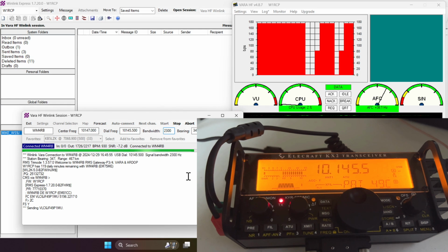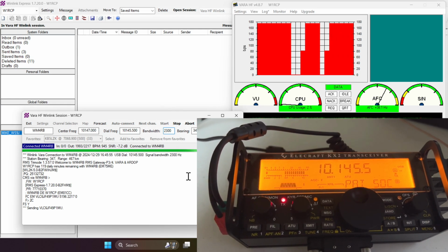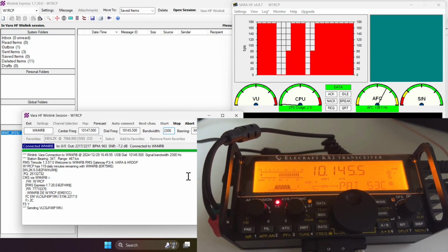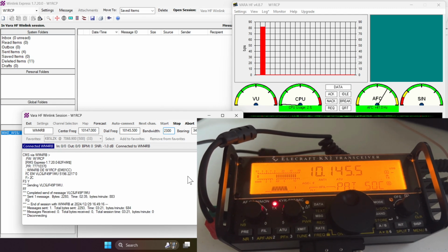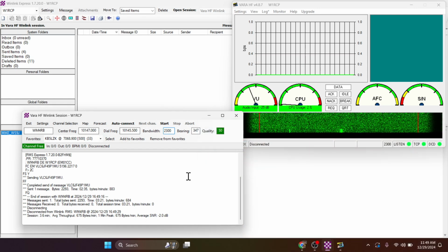As it's sending, you can watch the progress in the bar. It'll show you how many bytes have gone out and how many bytes are left. And once it's done, it has a few things to do before it actually disconnects. One of those is to send the time, I think, to the server on the other end, and then it sends out your call sign in Morse code.